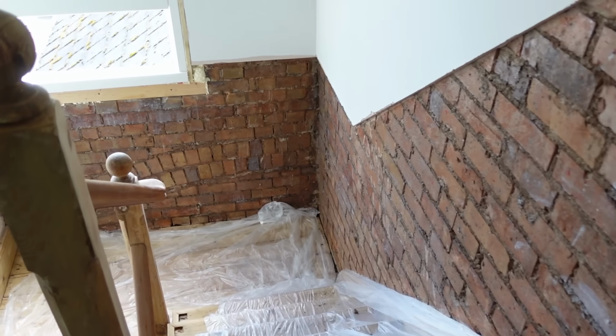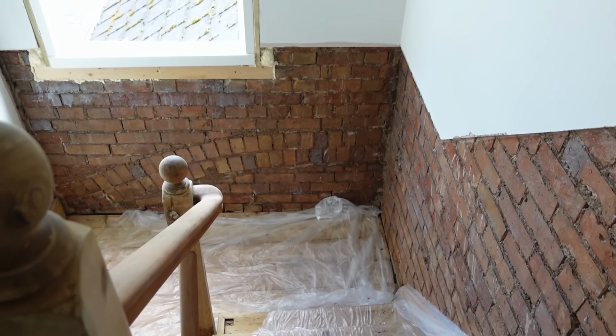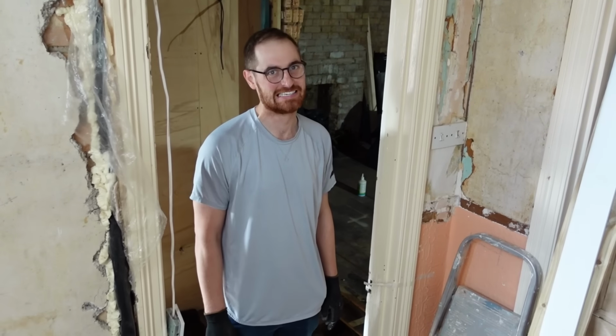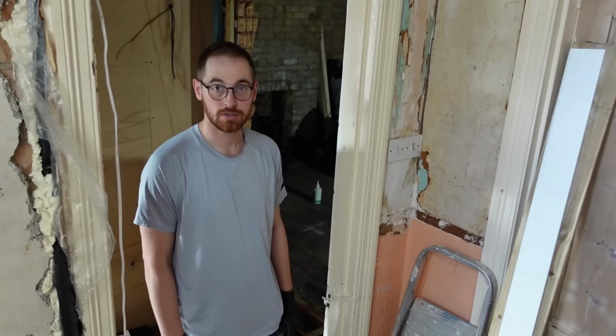PVA the brick. Don't they look better now? Now we're gonna hide them. Thankfully, because we were donkeys and we thought we would do paneling, we have the perfect cutout for this section. So we don't even need to measure or care. We're just gonna use them as templates. So we're gonna get the plasterboard up here, pop these on them, trace around them. Bob's your uncle.